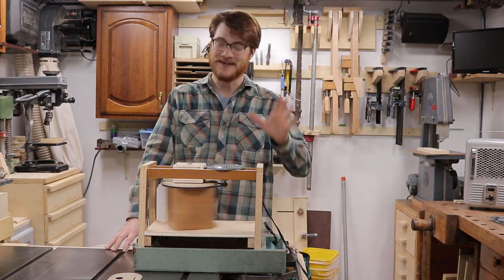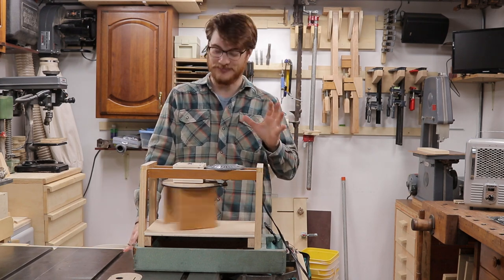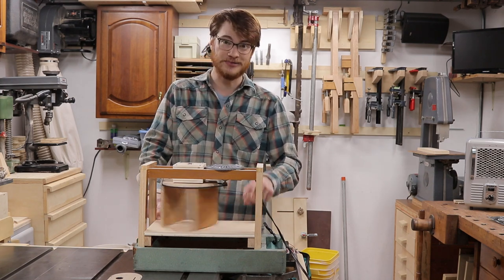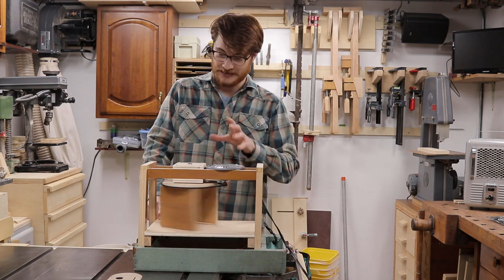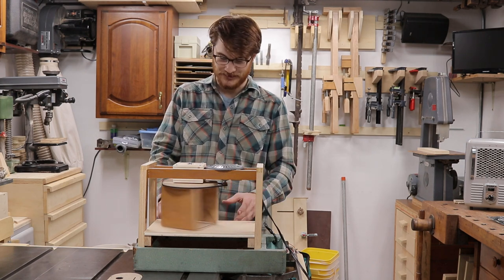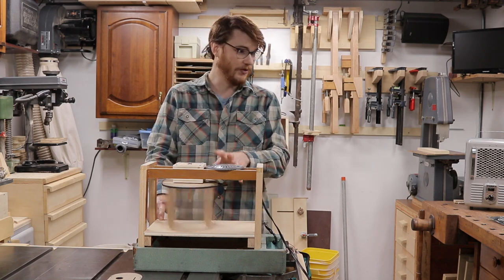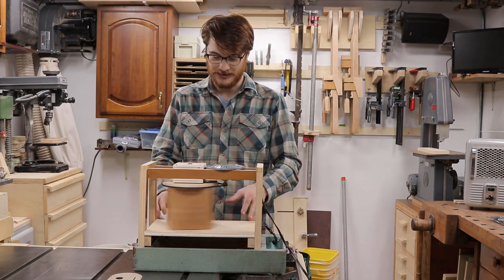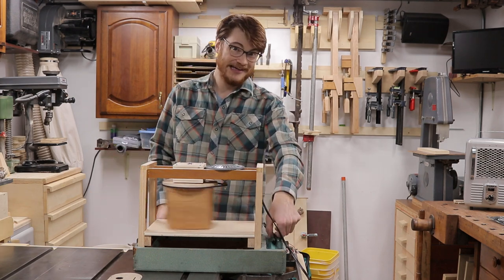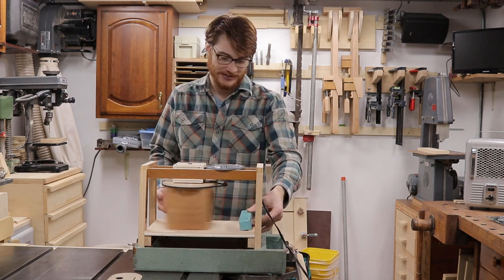Check it out, it works! This is awesome. Super excited to get to this point. I know now it's going to work, so I'm really excited to finish this project up and actually hear how this thing is going to sound. I waited until now to cut the hole for the speaker in this baffle board because I wasn't sure if this was going to work with the spinner baffle thing completely free-floating there with nothing supporting it underneath — but you can see it's working. So I can go ahead and cut that full hole out and not leave any supports for a bottom bearing or anything like that. I'm going to cut that hole out for the speaker, figure out somewhere to put a quarter-inch jack, and then figure out a way to put this old sewing machine light in here because that's just going to look really cool.